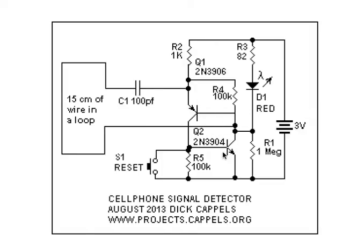When these transistors are conducting, Q2 is saturated and that's enough to draw many tens of milliamps through an LED. I'm using a 5 millimeter LED and I decided to drive it with 15 milliamps. For the purpose of calculating the value of the resistor used to set the current, I made a simplifying assumption: when Q2 is saturated, there's 0 volts between the collector and the emitter.